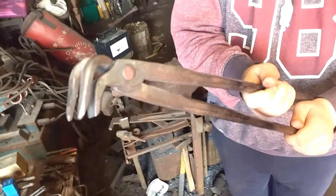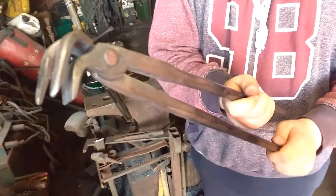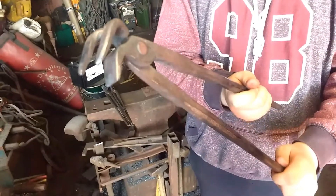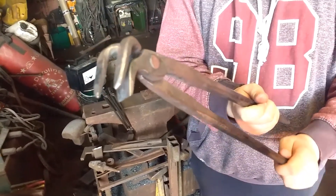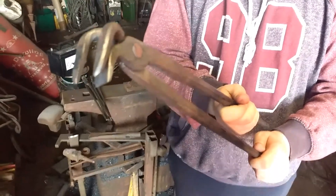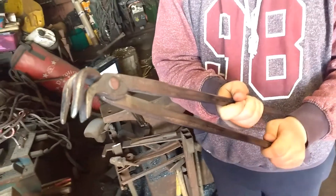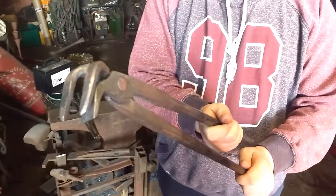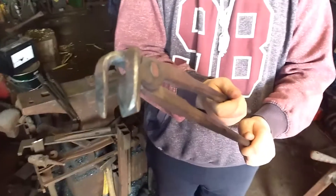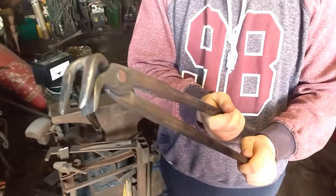These can be adjusted to your own needs over there, because we don't use railway spikes over here — we use clips. So they might need to be tweaked a little bit. Just there and there, just a little heat will do it. And because they're a mild steel, it won't matter — you're dipping them out. But I let the heat run back into them anyway.